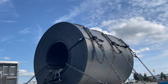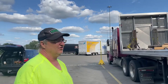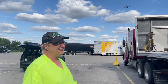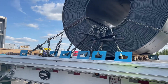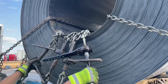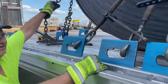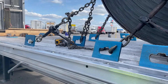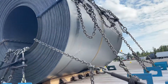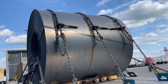So I have a 61,000-pound single coil on. I have nine points of contact, so I've got nine chains on it. I butterfly my Speedbinders in the center, so I have four pieces immediately in the center. And then I have one on each end for my give-and-go so that it's not tugging. And then I put three drapes across the top. The drape chains, to me, are important.